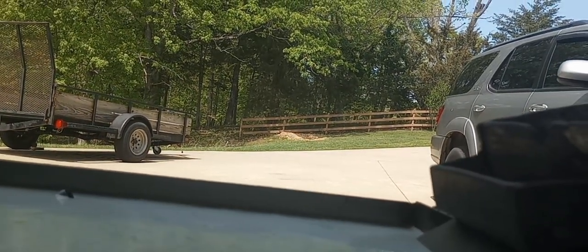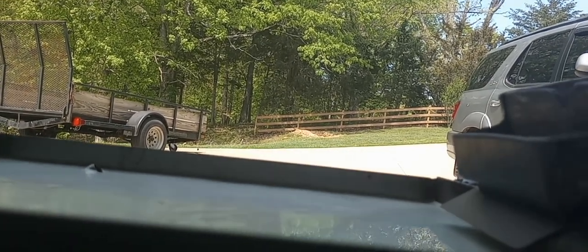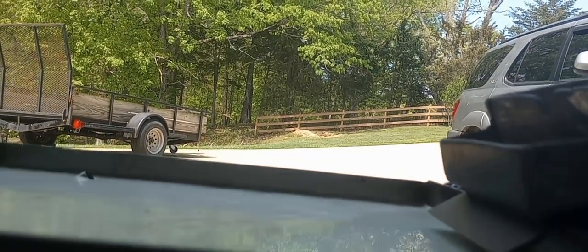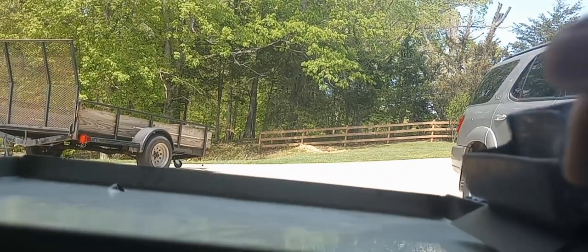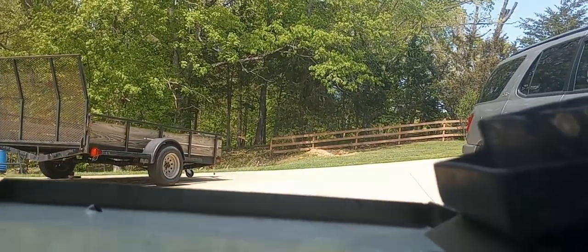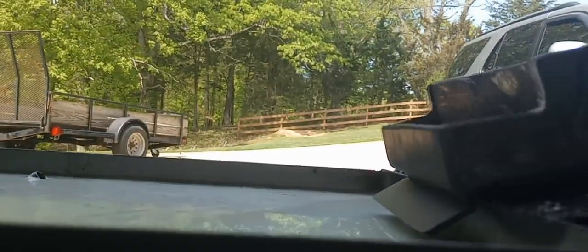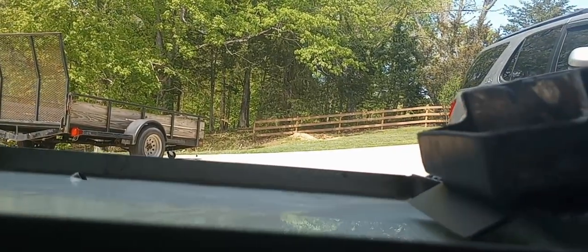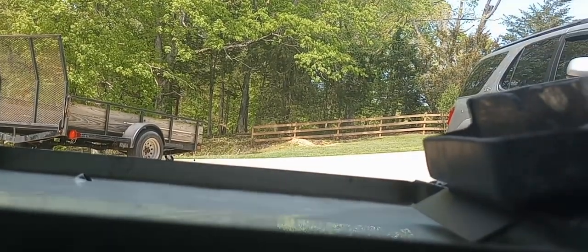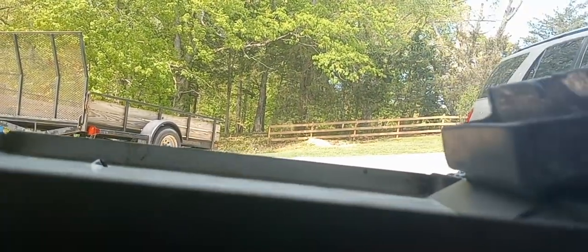And my subscriber was asking me some things about drop distances, the length of the ramp, and the angle of the ramp. So the ramp sits at about, if you put an angle gauge on that right now, it's going to say about 32 degrees, and the angle of the burner is about 12. So you've got to make those two work together. You set this at 12, and your angle when you weld this onto the bottom of the pot should come out to 32 degrees when you've got it sitting on your burner.